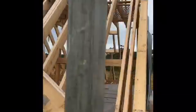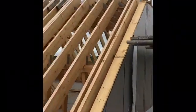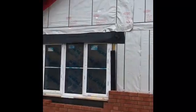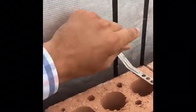They're just going to start framing this one out, so you've got that plot there. The frame gets delivered, it comes up, and then moving over to the next stage — you've got fire socks all the way through. You've got the vertical DPC, which has got to finish up at the top, and a 50mm cavity, and then you've got the timber frame.